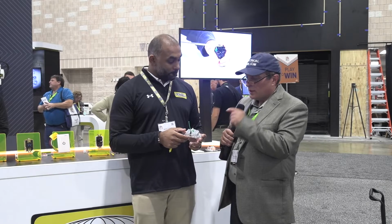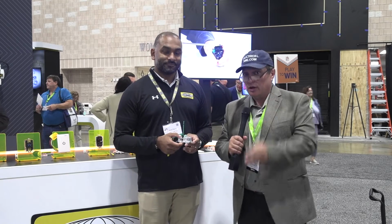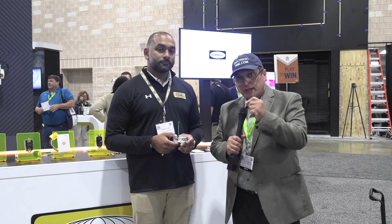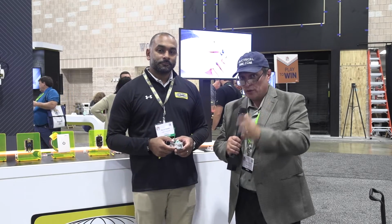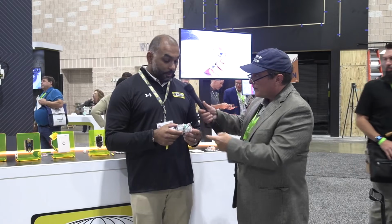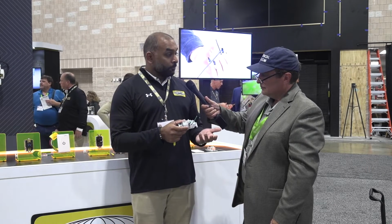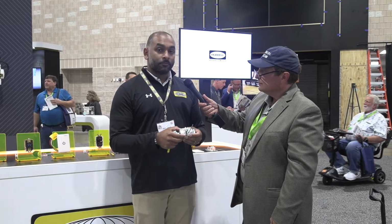So Benny, you mentioned something really important. Benny mentioned torquing. So that's a requirement of the National Electrical Code. And if you buy anything like a receptacle or a switch, and you look at the instructions, it's going to have torquing information on how tight you're supposed to be making those screws, those terminals. So with this device here, you really can't make any mistakes at all. Yep, 0 mistakes. We make it as easy as possible. That's why we've also color-coded the plungers as well, to make it easily identifiable for every customer to be using. And to your point, the code and instruction sheets list torque requirements. It's hard. It's different for every manufacturer. It's not the same, so everybody's got to keep track depending on who you're using. This removes all the needs for that as well.